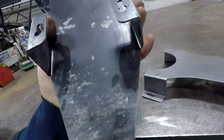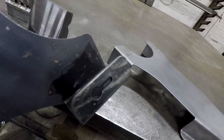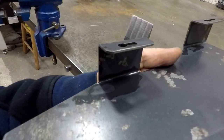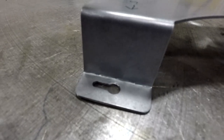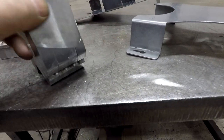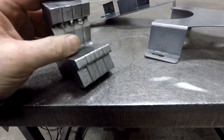If you can see it in there, you can see it here. It's hard to tell with the mill scale, but it gave a pretty good crisp bend. There's a little bit of deformation on the one end compared to the straight across, but it's still way better than the deformation you're getting from all the individual dies. Almost acts like a solid piece, even though it's 4 half-inch dies. But that seemed to work out okay.